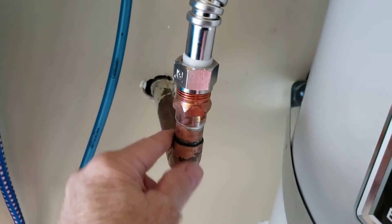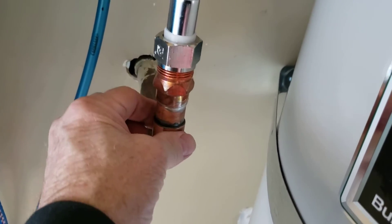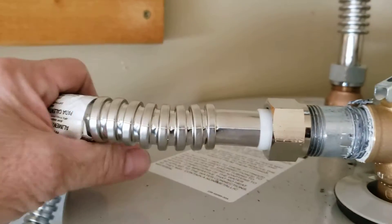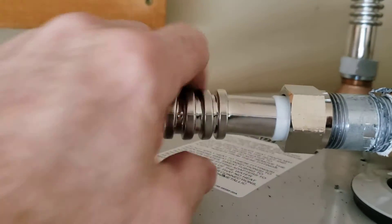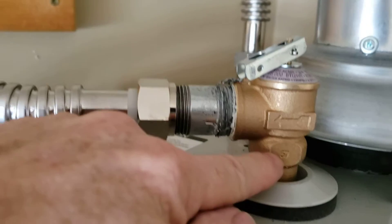This is not strapped in the wall — we didn't install it — so not much you can do with that, but it's not a big deal. This is just a drain line. This one is not a Falcon stainless steel — it's just a Pro Flow, straight out of Ferguson, flexible corrugated line that goes down. It's just a drainage line and is not under pressure; all the water is held back right here by that valve.